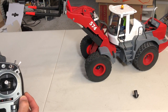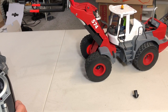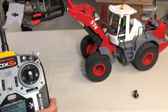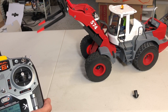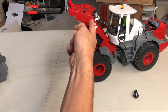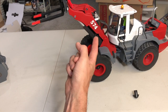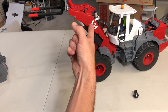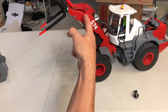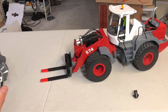You just go up and can tilt it either way. The one thing I do think that could use a little adjusting is when you go to dump your forks, you could almost slightly over-curl — that's where you want to watch the lineals and make sure it's not pulling up on anything. It should be right at the max point where it's not putting a bind on the body, not trying to force the body up, and not trying to overshoot the angle on the curl arm. You guys should be good to go.